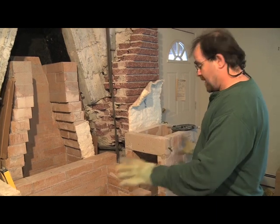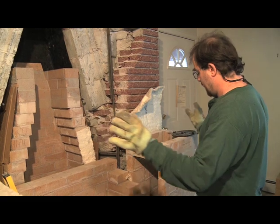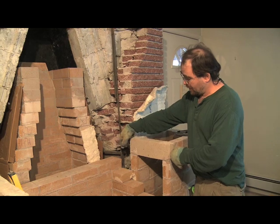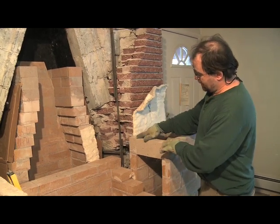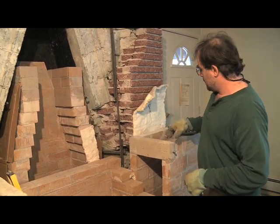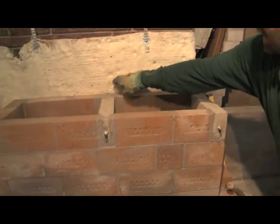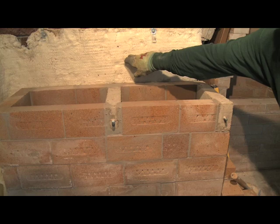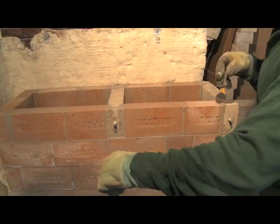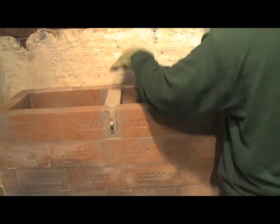And there'll be straps that tie the whole front face of this, steel straps, to hold the whole body for the seismic weight. So these rods, in theory, hold the tension load, and the cast part itself holds the compression load. So these are cast in concrete. There are others that are actually epoxied back into the wall. So these are drilled in and set with a high strength epoxy. So again, this provides a tension force on the bolt and a compression force against this wall.